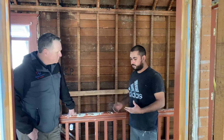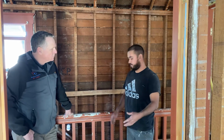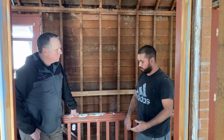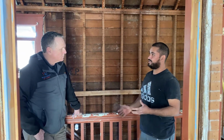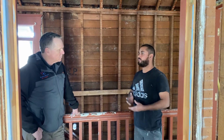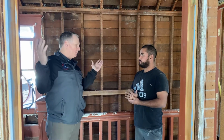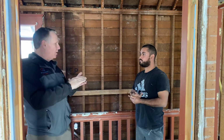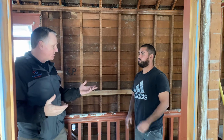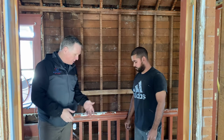I mean, if you have a little bit of time, get there in the morning, seal your collars, let it sit in the sun for about an hour, hour and a half. That should let this dry. And before you install your plenum to the air handler, you can put a little bit more. I know it's kind of going the extra mile, but it's going to be better in the long run. You're going to provide better quality of work. Well, it seems like, by putting in a system like this, we're going the extra mile already anyway. Yes, correct. So just a little bit more incremental work to make it come out right every time is really smart. And you're the sage of this, right? To me, you're the guy with the most experience.